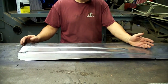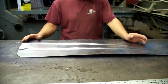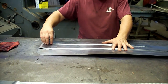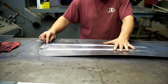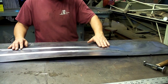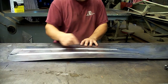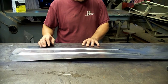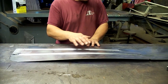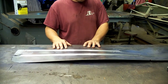Here's our panel. It looks like a disaster after it comes off the Pullmax because we didn't do any pre-stretching. Let me show you how to get out of that. On this end you can see we gathered up all this material, but we stopped right here. So we'll do a little shrink in here, we'll flatten this out a little bit right here and here. I'll show you how we put the ends to make these round — that's another tool in the Pullmax. Right now we'll shrink this and do a little hammer work to get it to sit back down again.